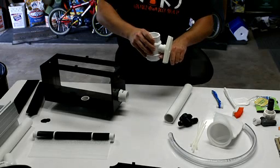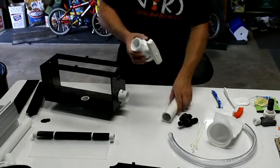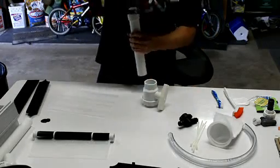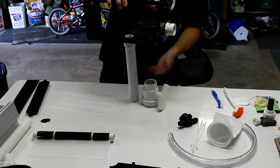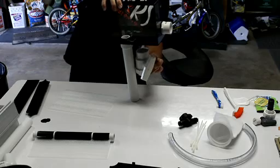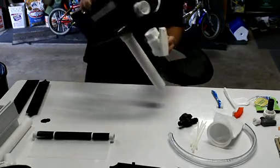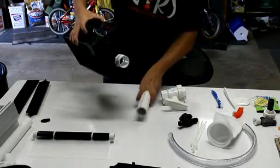What you want to do with this is terminate it just above or just below the water level in the sump, so that it creates a siphon on the drain. Basically you have your pipe for the drain of the unit, and you figure out where the water level is, and you cut the pipe such that the bottom of the valve would be there. So you'd only really need a small section of pipe to push in there. Again, it only needs to be friction fit, so there's no complicated assembly.